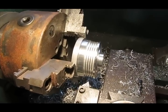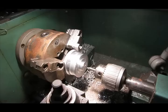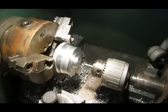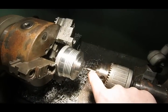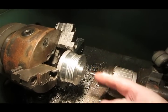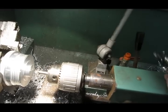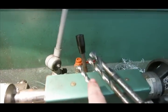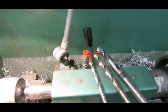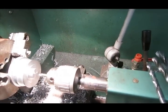I have some nice grooves cut in there, and the next step will be to bore a hole in the end the right size for the shaft. Now it's time to bore the hole in the center of my pulley — I'm going to do that in a few steps. What I have in the drill chuck right now is called a center drill. It's short and stubby and starts with a small point — its advantage is it doesn't wander when it starts drilling, so it'll start right in the very center. Then I'm going to step up two different drill sizes: a little more than a quarter inch, about three-eighths, and then one a little bigger than half, which will get me pretty close to size, and then I'll use a little boring bar to bore the hole to the exact diameter.